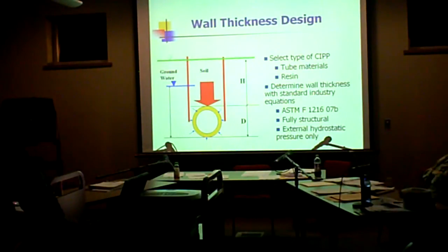This shows basically the kind of loads you look at. Obviously you have soil load on top of the pipe, but then you have groundwater loads. The ground pressure or water pressures are radial, so it's pretty much equal around the pipe in most cases. We run into problems sometimes when you have inflow and infiltration — you get these leaks.